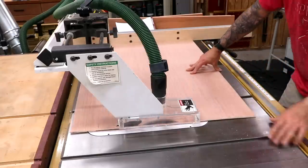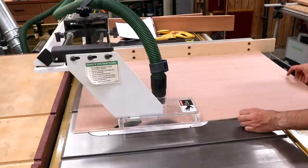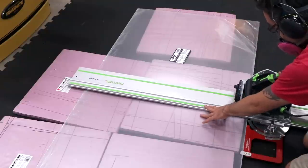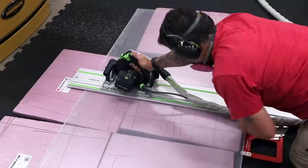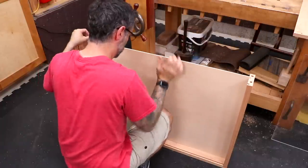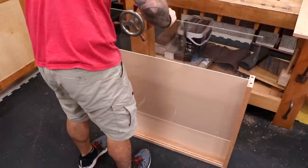The back panel and the plexiglass are the same size, so I'll cut the plywood first. Both sheets of plexiglass are cut at the same time using a plastic cutting blade on my track saw. By the way, plexiglass is ridiculously expensive! We want a somewhat loose fit here, so make sure that both the plywood and the plexiglass sandwich slide into the grooves easily.